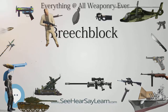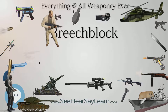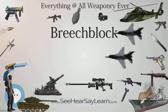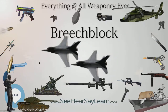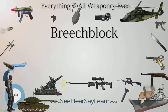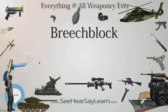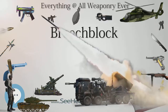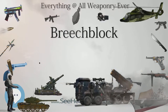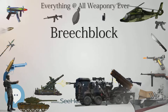Tilting Block. As a tilting breech block closes on the breech, it is tilted up at the rear but drops into a recess at the end of its forward travel, thus locking the breech closed. Firing forces are transmitted to the locking shoulder at the rear of the recess. To unlock the breech, a slide or carrier moving rearward uses a wedge-like arrangement acting on the sides of the breech block to tilt it up at the rear and lift it clear of the locking shoulder. The breech block is then pulled rearward by the slide or carrier to expose the breech. In the closed position, the slide or carrier can also help locate the breech block in its locking recess. The carrier or slide can be operated by lever or pump actions, or by gas, for automatic and semi-automatic fire.